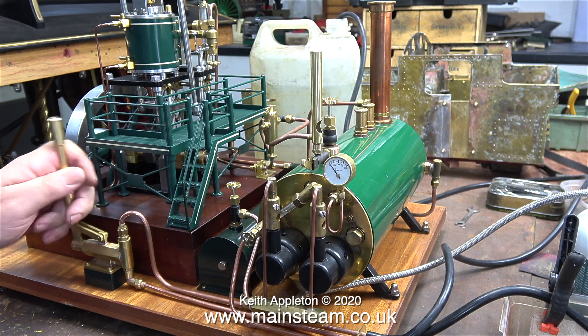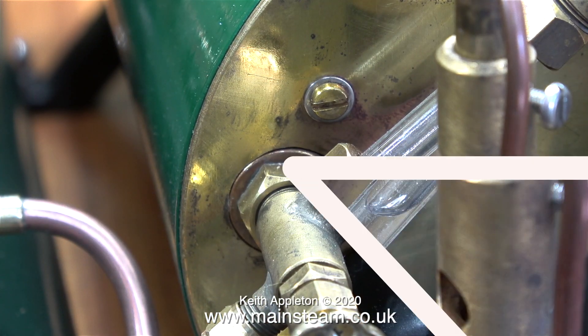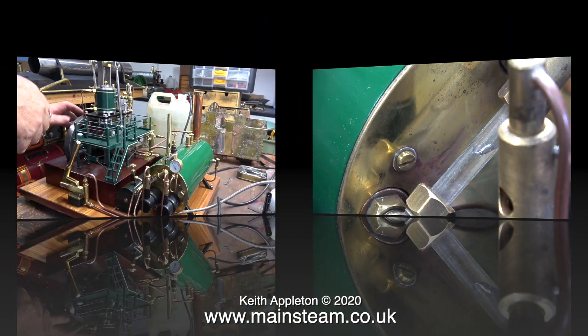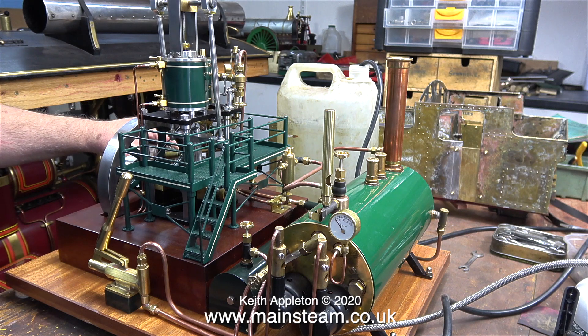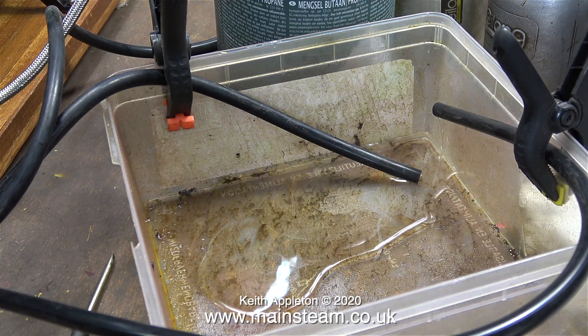It's time now to pump some water into the boiler using the hand pump. Because this is a gas fired boiler, this is enough water really, but I decided to pump in a little bit more, which just makes it take a lot longer to raise steam. I lit the boiler, and with its very small number 5 jets it's slowly raising steam. This is a good time to lubricate the engine — lubricate every moving part.